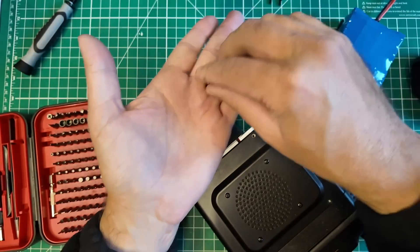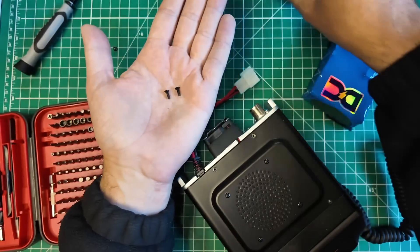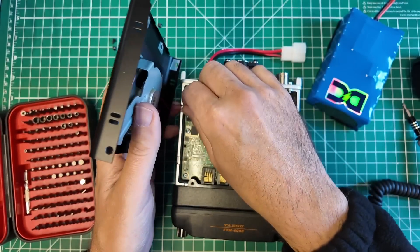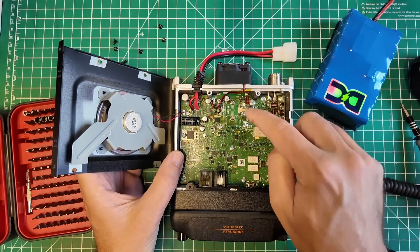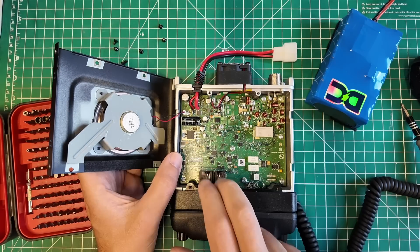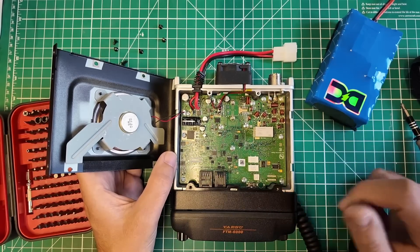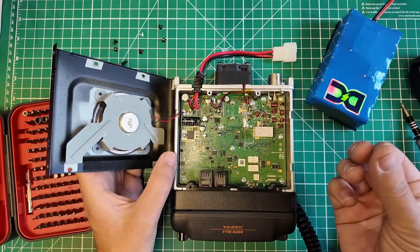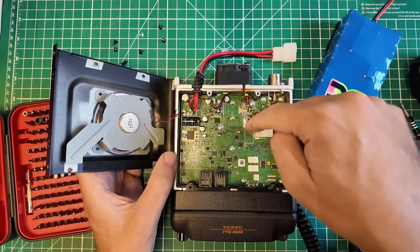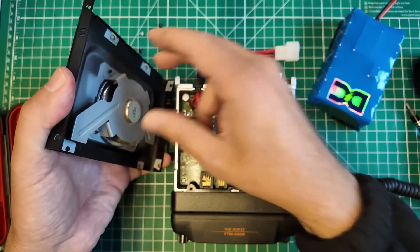The screws on the side are short, the screws in the front are long, and the screws in the back are short — be sure and keep those guys separate. We get stuck on the speaker connection, so we'll leave that plugged in for now. Looks like we have some filters over here, a transistor over here, the two jacks for the microphone and the control head, and some unpopulated headers. There's also some heat sink thermal paste that got pushed through, which leads me to believe our finals will be on the other side. The SO-239 connector is wired directly to the board and the speaker is very well held in place.